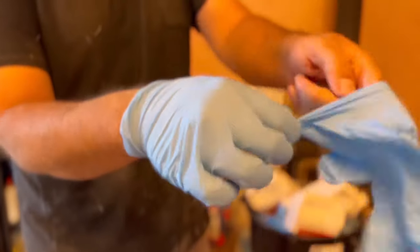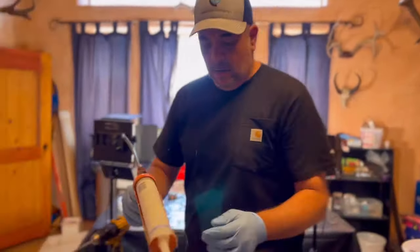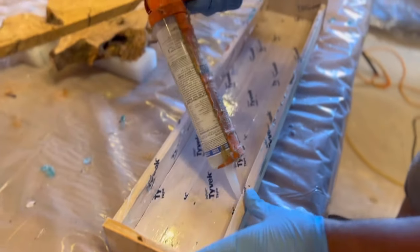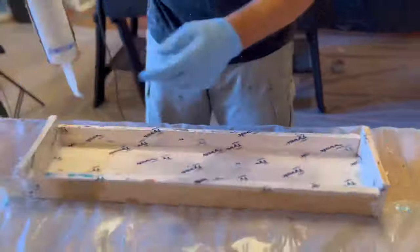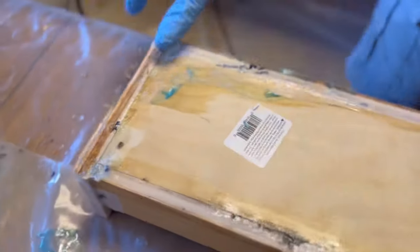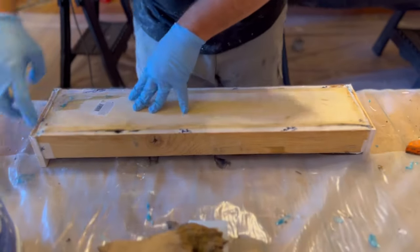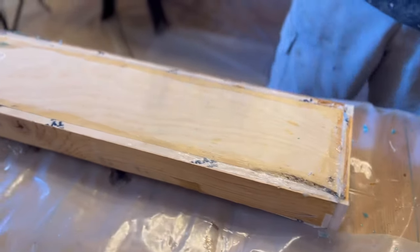Okay, let's go inside, tape it up, and get to pouring. Always like to wear gloves, folks, because epoxy work is a very sticky job. We're going to get our mold all sealed up — you always want to get all these angles, all these slats, all these corners sealed with silicone because you don't want leaks at this level. Boom! This excess — I like to get the edges here, catch it right there as well. We're going to let this sit for about 30 minutes.